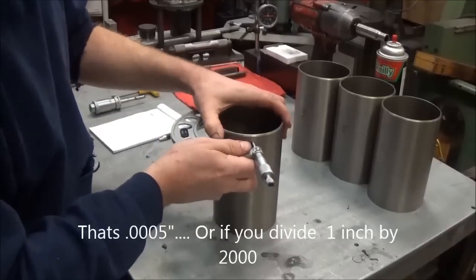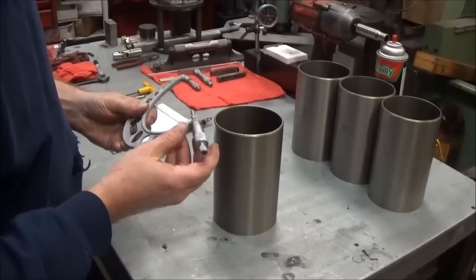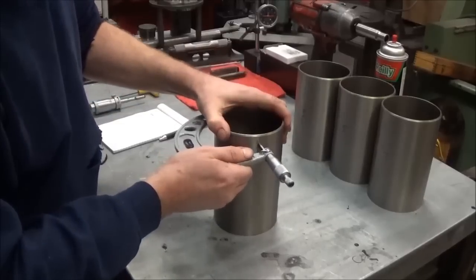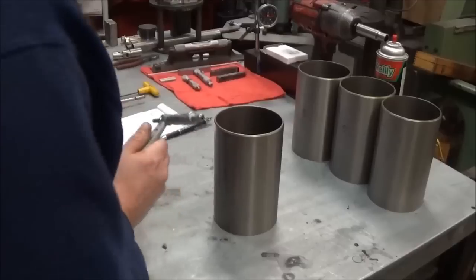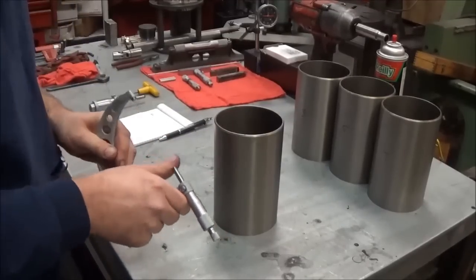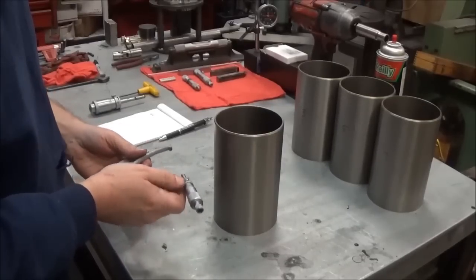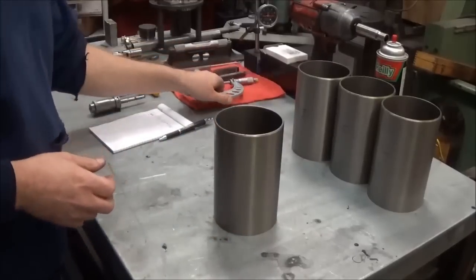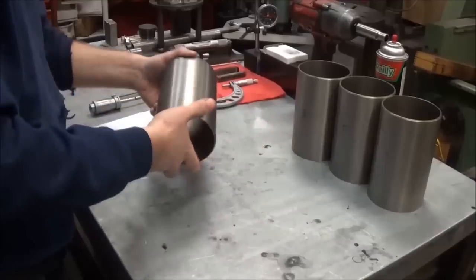It's actually about a half thou more than those. Right in there at half thou. So half thou, that's not too close of a tolerance, but it's really not necessary at this point. As long as we have, you know, that tolerance half thou or so on a press fit, it's not a big deal. So, all right.